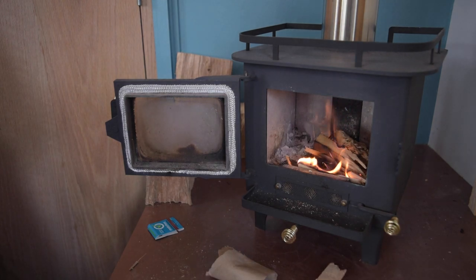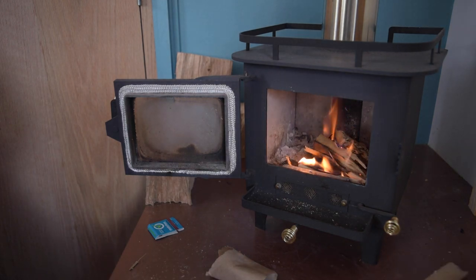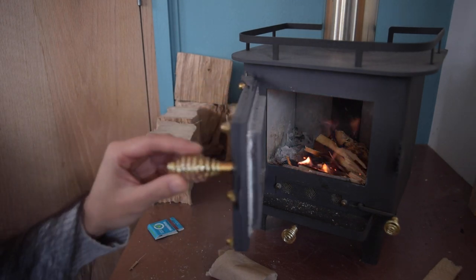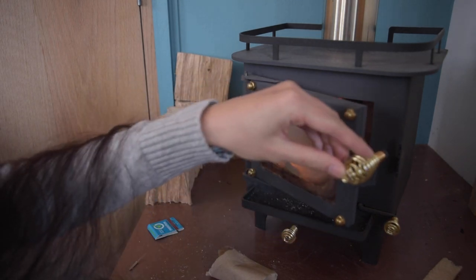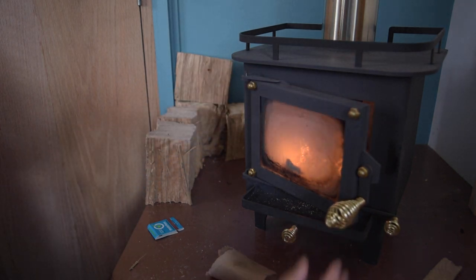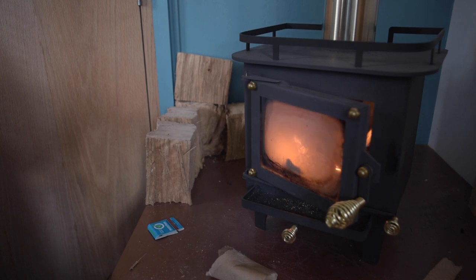The way a wood burning stove works is the chimney or flue pipe has to be warm to create a draft to make the heat go up and out of it. While it's still cold, it doesn't actually draw the heat out. So we're keeping the door all the way open to make sure there's enough oxygen and airflow to keep things started. Now we're starting to create enough heat that we can actually close the door a little ways — we'll leave an inch or two open and watch to see if the flame starts to draft up a little bit. As you can see, it's doing fine. If it starts to kill itself, open it back up, but we're starting to get a little bit of heat and creating a little bit of a draft.